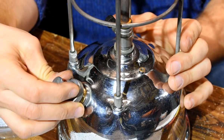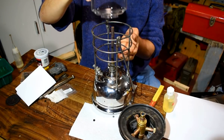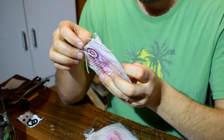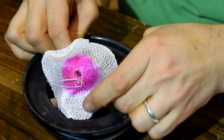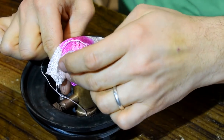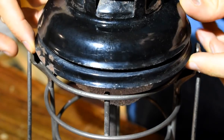Then the pump. I've been waiting for this for a long time — brand new glass. It's aftermarket but it looks pretty good. I got these Petromax mantles a few years ago and was surprised to find that a bunch of them were double tie. Actual Tilly mantles are available and they're a little easier to install. Installing a double tie mantle can be frustrating — take your time. Remember the bale clips when installing the vent.